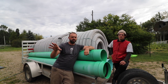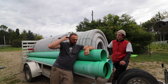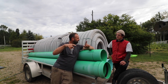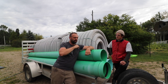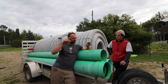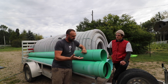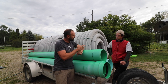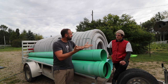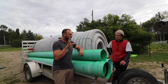One of Mitch's projects, once it's installed, is to install temperature monitoring sensors in various locations — inside and out. We're going to measure outside temperature, inside ambient temperature, intake air, outlet air, and several ground sensors in the greenhouse itself to see how ground temperature changes over time. We're going to see the delta T — the change in temperature — across the heat exchanger. We're basically building a giant heat exchanger. We're also going to see how much energy the ground absorbs from the air. A lot of these temperature sensors have humidity sensors built in, so we'll measure the change in humidity too.